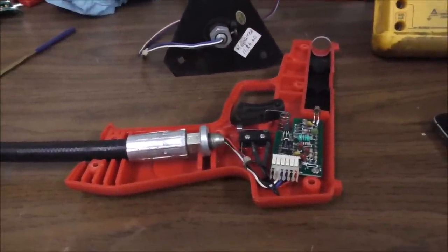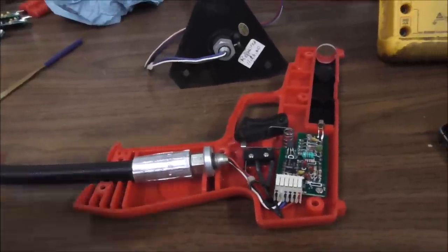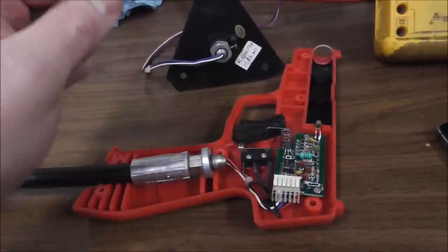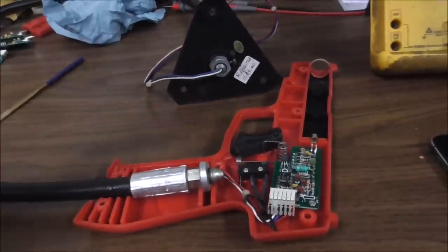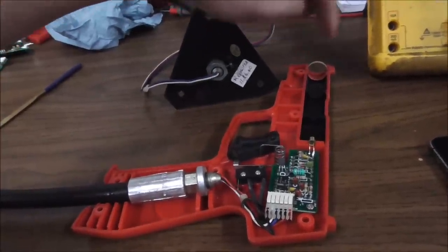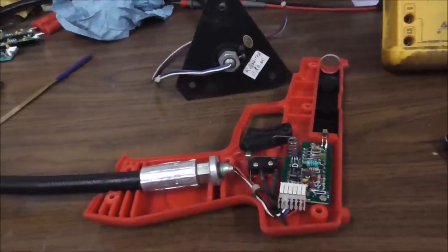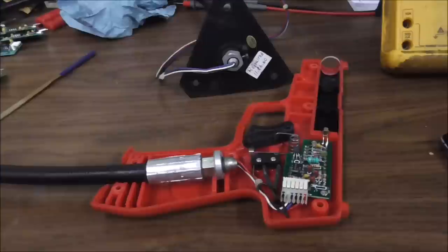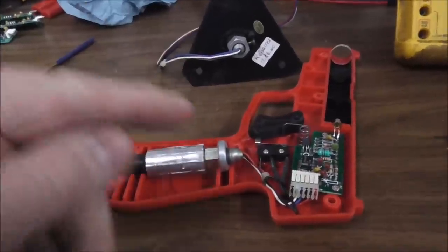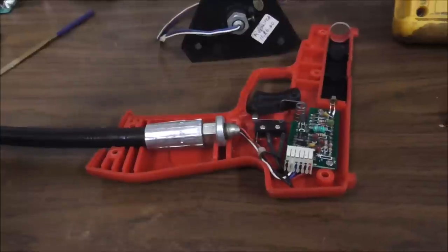Okay, folks, I've turned it sideways just so the cable will fit on the desk here. This trigger may pop out at any minute because the spring's holding it. But basically, you have a lens up here. You have to clean that, put it in. You want to clean off the front of the optic. That hardly ever fixes it, though. If you have problems, it's usually not that. It's if the optic is broke, like if one of the legs is broke, that's usually your problem. Or this plug has slid off. That's very common, happens all the time.